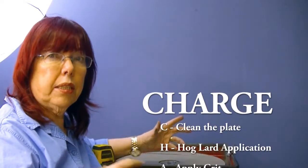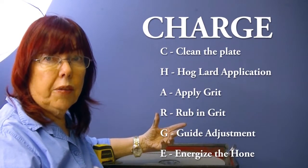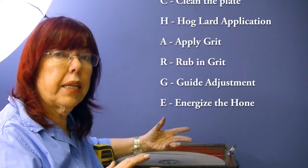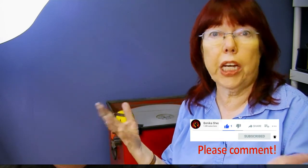So that's charging your plate. You're going to do that between about every six blades, or when you see the sparks going down. This is a simple way to remember all the steps. Other people may have other methods and I'm not saying they're wrong — this is just the simplest, most consistent way of recharging your hone. We have lots of videos on sharpening shears and clipper blades, with our best ones on our website. We also do hands-on training around the country and in our offices in Atlanta. Download our information package, and please subscribe, like, and comment.